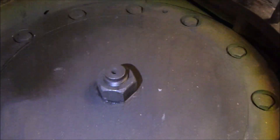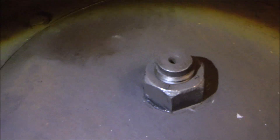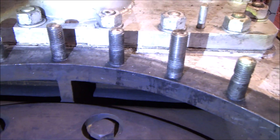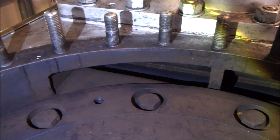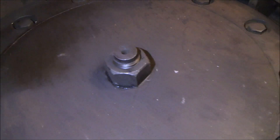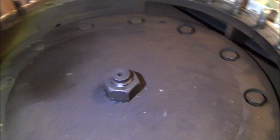The low-pressure piston is back inside the engine where it belongs. They ran the piston up and down inside the cylinder to get it settled, then ran a new set screw in through the nut — and it's good to go. Just have to cut a new gasket and put the head back on. You can see that the piston sits right at the lower edge of the inlet from the valve, so there's enough space for steam to get on top of the piston to push it down. This is top dead center for this piston.